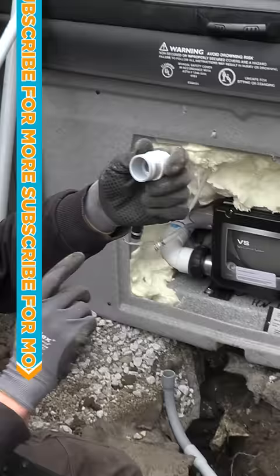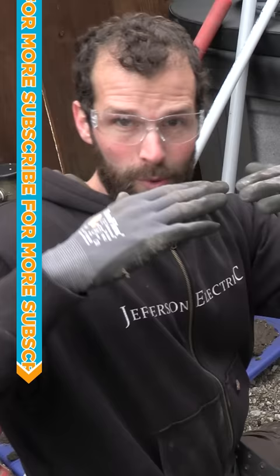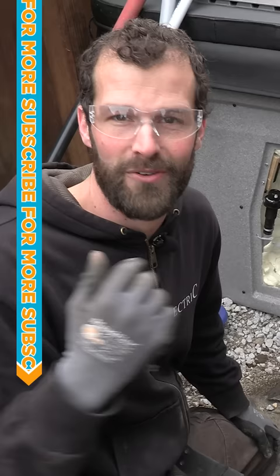The coupling depth there is less than three quarters of an inch. When it separates and pulls apart, ground conditions change as the dirt settles, and now you can no longer pull wire through it. You've ruined the installation.